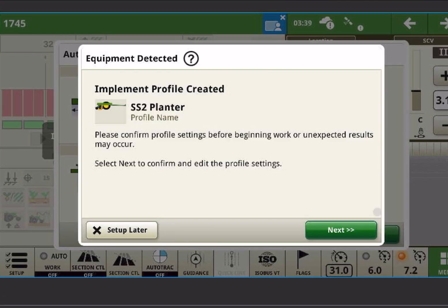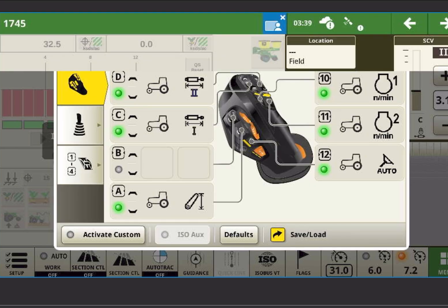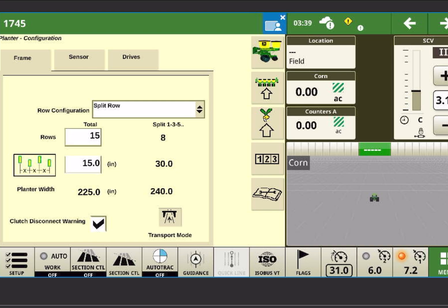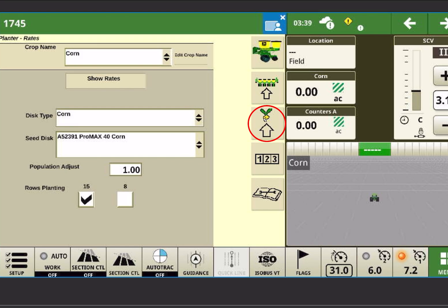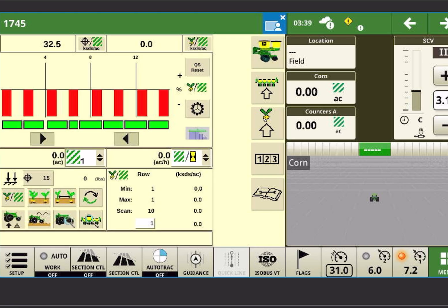I'm going to reconnect my remote display access session so you can see the screen. I'll click Accept and can set that up later and update my track spacing. Now you can see I have my clutch sections exactly how I configured them before. My planner is a split row, 15 rows, 15 inch. Going into my seed button, I've got to set this back up — I'm going to select eight rows instead and update to 20 feet. Coming back, I have eight population bars — those are my eight rows of corn — and you can see here at the center, what would be row 7 or the fourth row of corn, has a clutch all on its own.